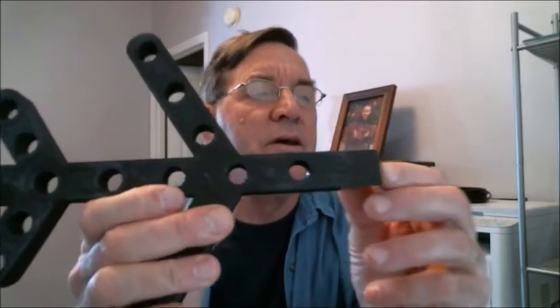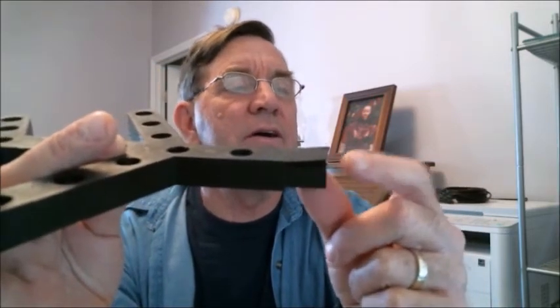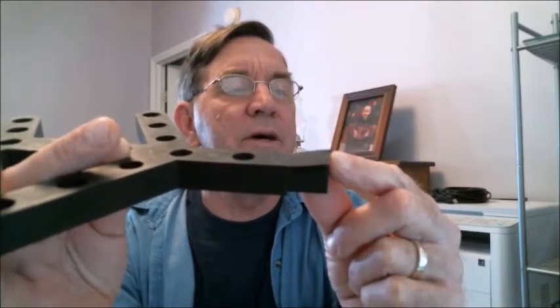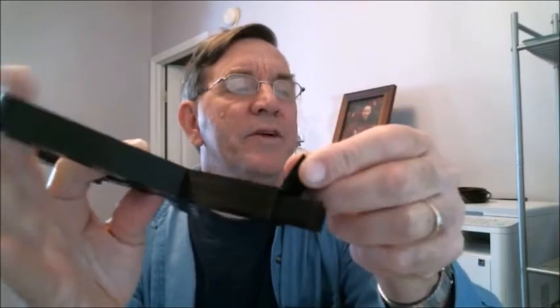Also on the snowflake arm, you're going to see right here there's a little tab that I've added to it. If you do 3D printing, you know that in some places you have to use support. I found that on my printer this little area here, the support did not adhere very well to my print bed, so I added this tab to the model. Whenever you print it, this tab is only a 64th of an inch thick, so it breaks off very easily right along with the support material.